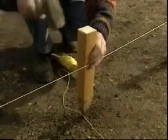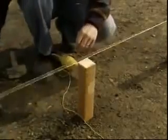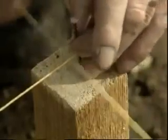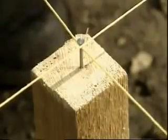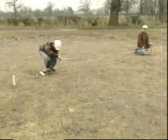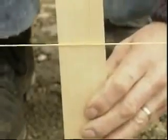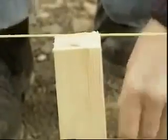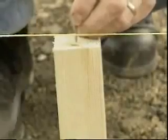Transfer the building corner mark from the curb onto the building line. This intersection establishes the first corner of the building. From this corner, measure the length of the building along the building line to locate the second corner. (4.640 meters) in this case.